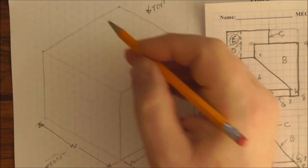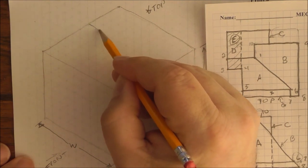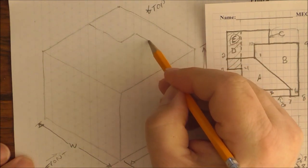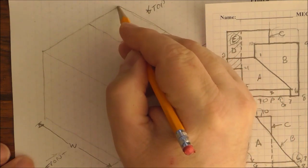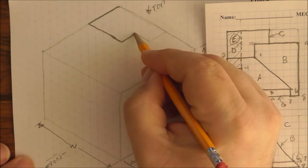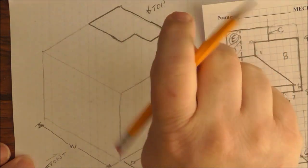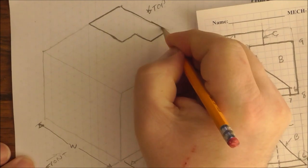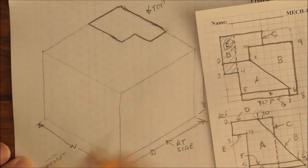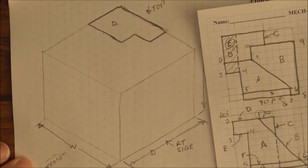So if I were to draw this thing, this back corner is right here. I'm going to go 4 units forward, 4 units to the right, 2 units back, 2 units to the right, 2 units back, and back to the beginning. As soon as you know where an object line is, darken it in. Keep your construction line for the box very light and make your object lines very dark — your mind will quickly pick up on that and help you visualize. That is plane D, and it's the only thing touching the top of the packing box.